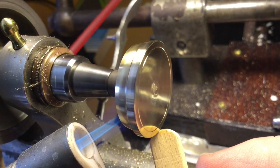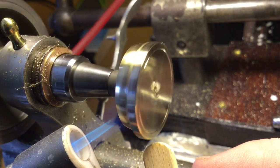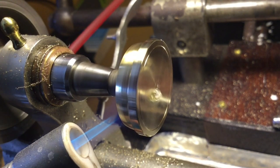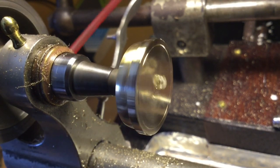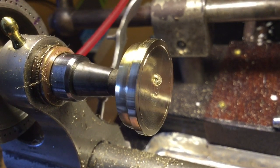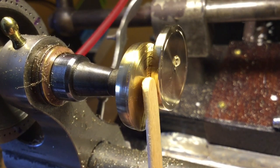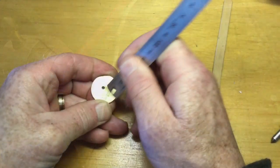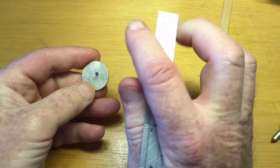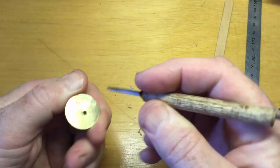I'm warming the chuck and gently pressing on the work with a paddle pop stick to remove it — you can see hot melt glue coming through the hole near the center. I'd also engraved a decorative border line that would be my guide for the four leg holes. Shellac dissolves in methylated spirits or denatured alcohol, and super glue dissolves in acetone. But hot melt glue? Mechanical removal only.